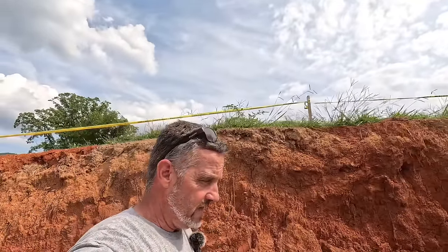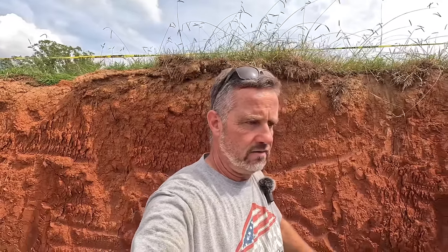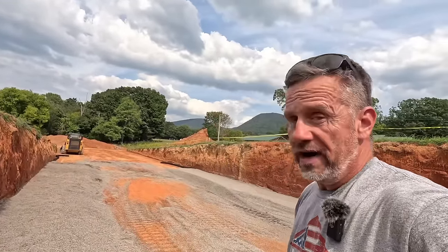And I have used the rake a whole lot more in this job than I really wanted to. But I'm learning. And I did call just to make sure. I called the rep for this company to ask him what the grade tolerance was. You know, obviously they'll want it perfect. And that's what he said. You know, they'd like to have it as perfect as they could. But, you know, this fine rock and packing that in, it rises and falls in that. So I'm a quarter to a half inch on grade all the way around. And he said really an inch is fine. I'm well within an inch.